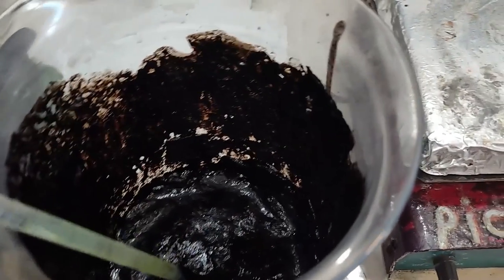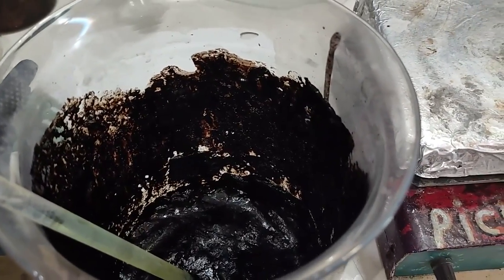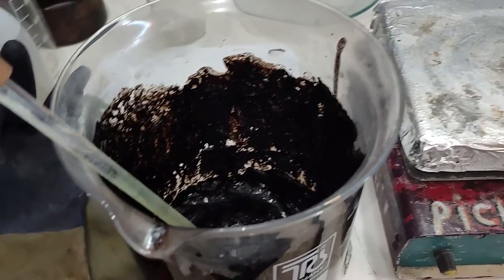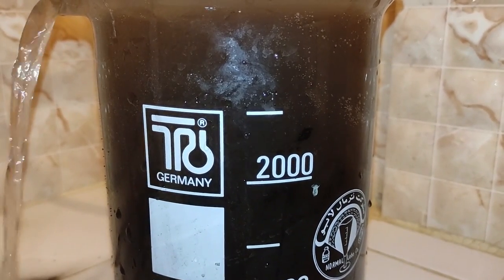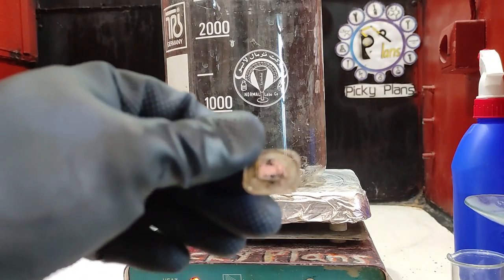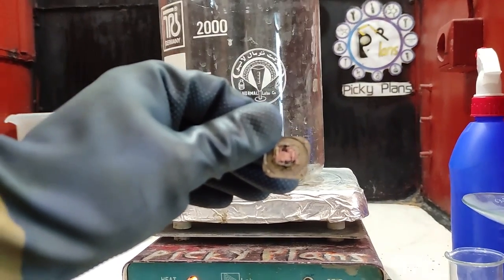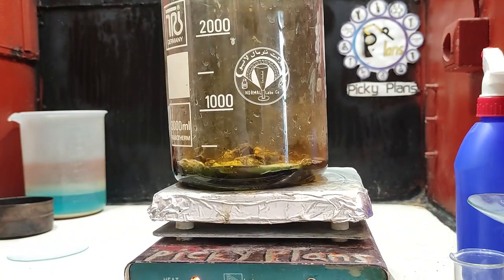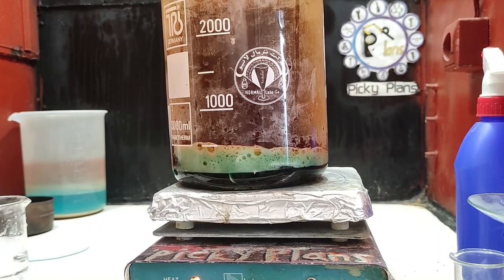Now I need to wash this stuff to get all the carbon out to be processed and dissolved with aqua regia. I washed all the BGA chips with water flow while placing a strainer in its way to not lose any gold bond wires. All residue was washed carefully and I took the copper heat sinks out. Now it's ready for base metals digestion using nitric acid. I added a few milliliters of 50% nitric acid to dissolve copper. It took about 30 minutes to be done. Here are the gold bond wires ready to be dissolved in aqua regia.